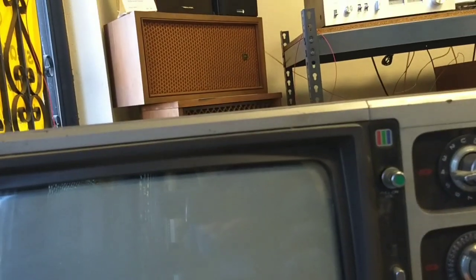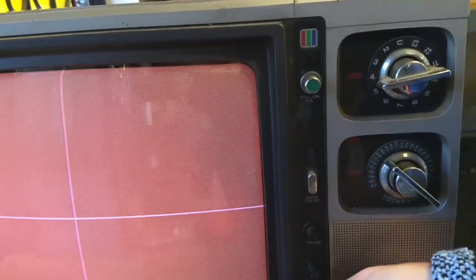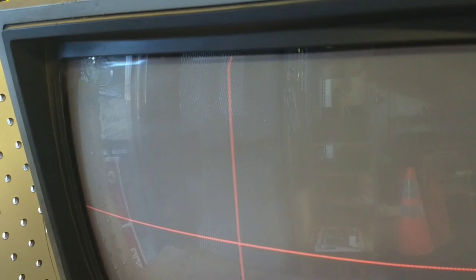Let's do some setups. Let's turn the brightness up to about two-thirds the way, and let's turn up our red a little. So there's our red with the brightness all the way up — let's turn it down to about two-thirds. My red's almost maxed out; that doesn't surprise me. So we just have a red raster there. Let's fiddle with the green — and we're looking for that nice amber color. And then let's mess with the blue — see if we can get blue.